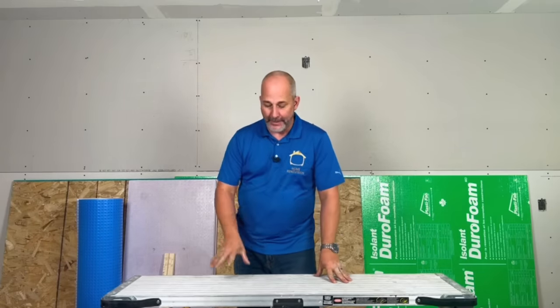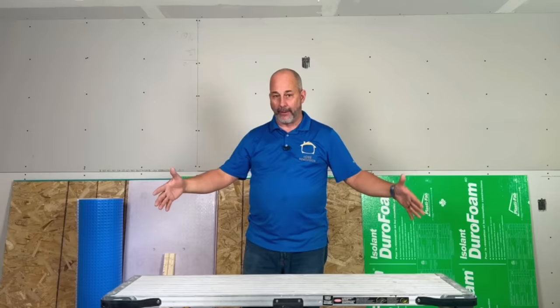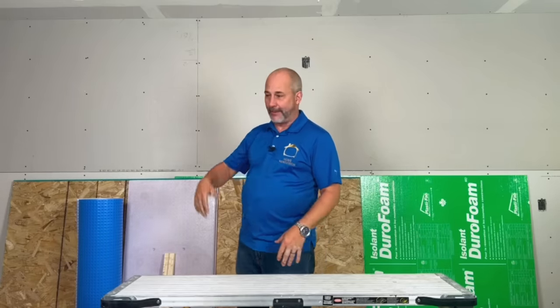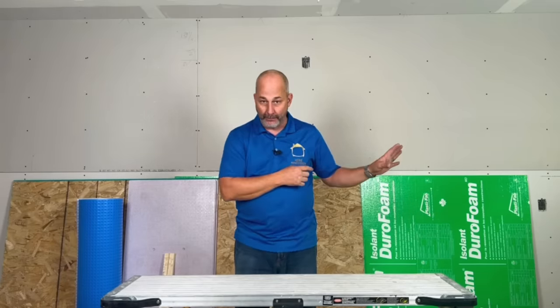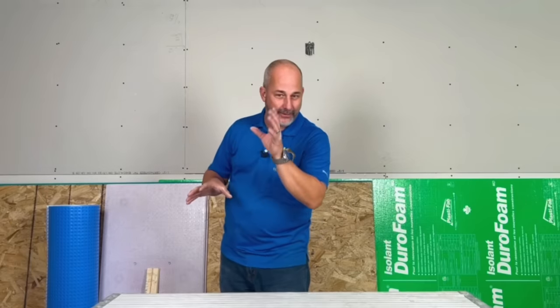If you have an older house, you're going to have moisture issues and vapor, so you need a subfloor system. The best plan is to put it down first and then put up all your walls. Most people already have walls in their basement — it's still an improvement, but it's not perfect. We have another video on why and how to assemble. What I'm talking about today is what kind of system should you use in your house.